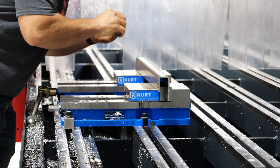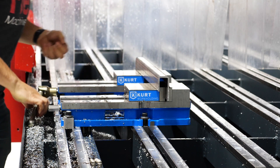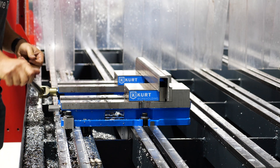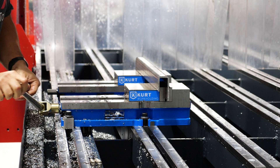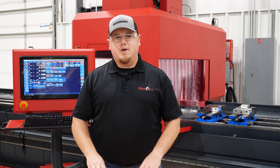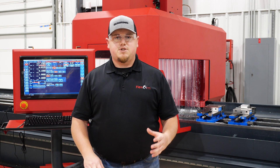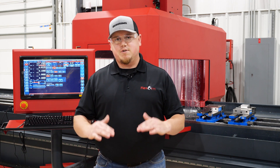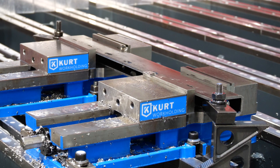So we had a couple of different operations, as there were features on multiple faces of this part. In the first setup, we had to figure out the best clamping method. We're not set up for every single custom fixturing solution, so we try to do the best we can with what we've got. The big key in the first operation was putting a little bit of clamping force down on the bottom of the J, so we wouldn't get the material to pop up on us in the vise.